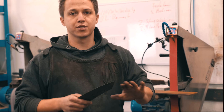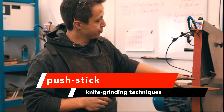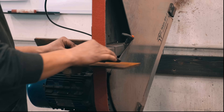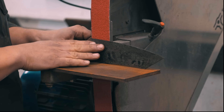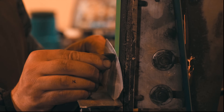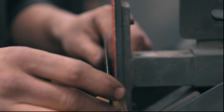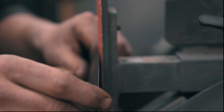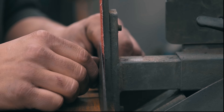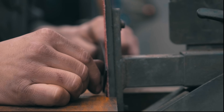Next up would be what's generally referred to as the push stick technique. Now we are using a work rest. We're going to have the knife on the work rest — it is completely free to move so we can work with the tips of our fingers or with a push stick. I can use a piece of wood to control the pressure and the angles. Typically you will want to start a little bit steeper, grind approximately to the middle, and then start moving your bevels up shallower and shallower until you are where you want to be.